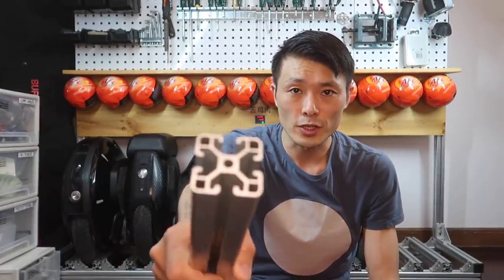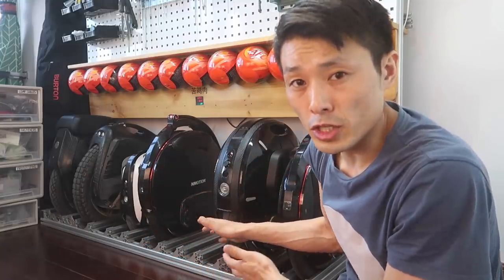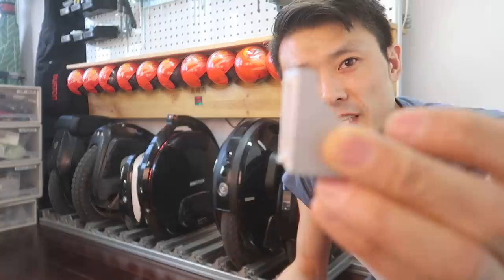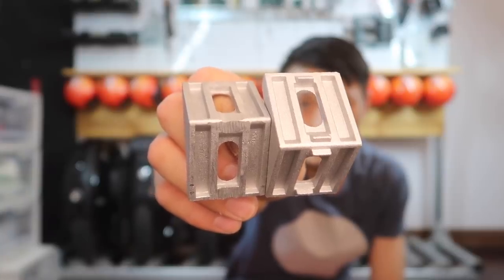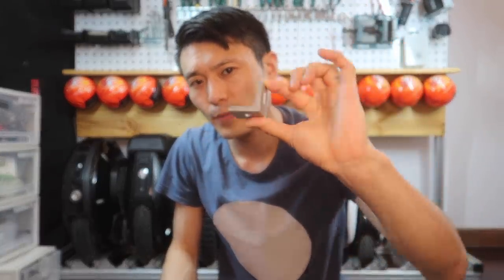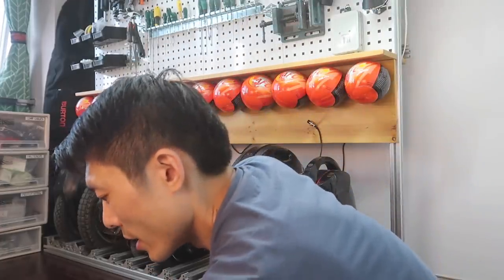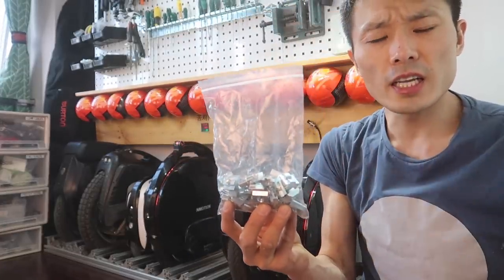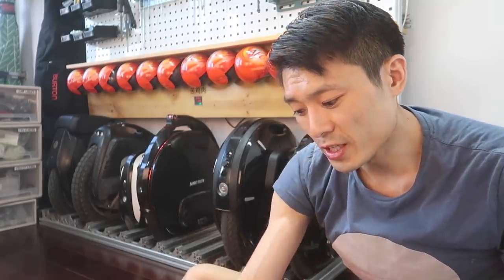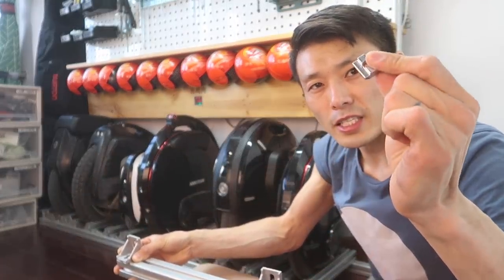There is a fair bit of work that needs to be done to make this happen, but it was well worth it because my wheels are way better organized than ever before. I used aluminum extrusion pieces about 38 centimeters - roughly 15 inches - long. You could probably use other materials, but I used aluminum extrusion because it's really cheap in China. The cheapest L brackets have little nubs on them, so I used an angle grinder to shape them down. They also have 40 by 40 aluminum extrusion L brackets which are more expensive but should also work. I have a bag of M8 by 16-millimeter screws and a bag of T-nuts. I have 16 bars, and each one needs two T-nuts, four screws, and four other nuts.